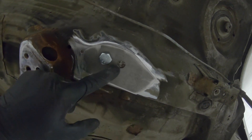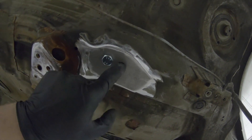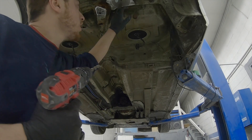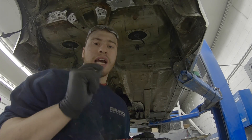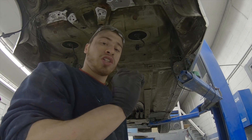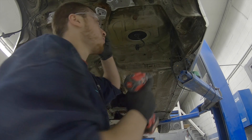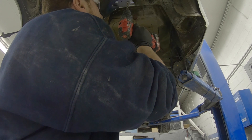I'm going to get a bit and drill through this first plate. After I drill through this first piece of sheet metal, I'll be able to do the rosette weld. With your half-inch bit, you're going to drill through the first outer layer of sheet metal — you don't want to go all the way through, just through the first layer. Once you weld it up, you're combining all those sheets all the way through, strengthening the brace.